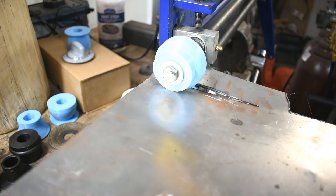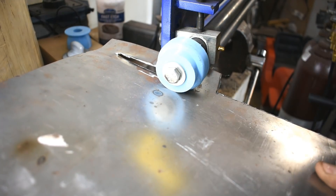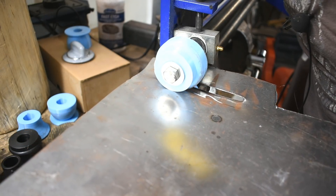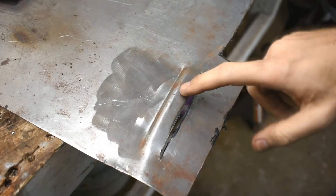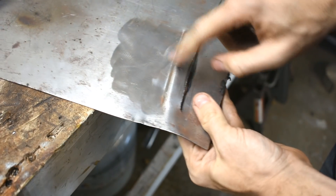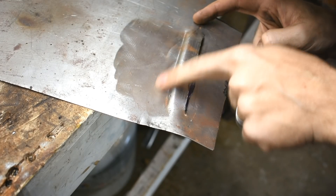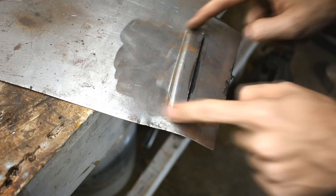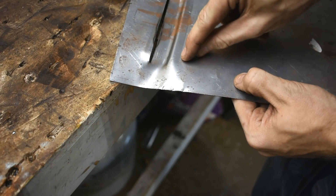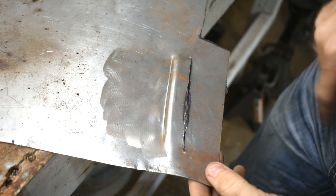I can't give up yet — I also cut a groove in a piece of steel. It'll probably destroy these dies, but that's fine since they don't fit anyway. Going in pretty tough, so we're going to give this multiple passes. There — crank it a little more. You don't have to do all the shaping in one pass, or so I've been told. So for whatever reason, my quick-and-dirty bead roller dies — which I thought would be great for shaping aluminum — suck at aluminum and work for steel. A PLA bead roller die worked for steel. Figure that out. It actually looks really nice here; the edges look cruddy but with louvers you have to finish the edges with a different method anyway. There's an extra line here, so I'll probably have to allow for that in the die design as well.